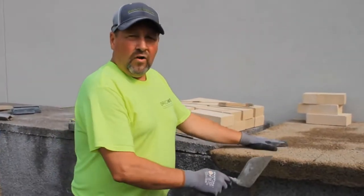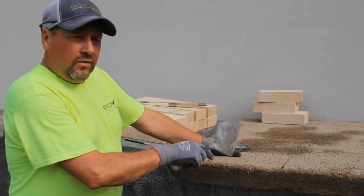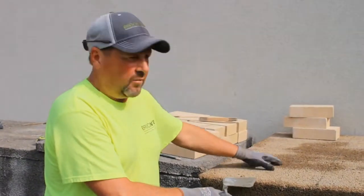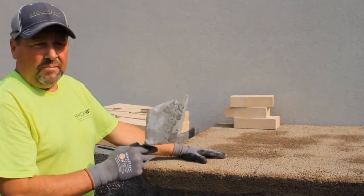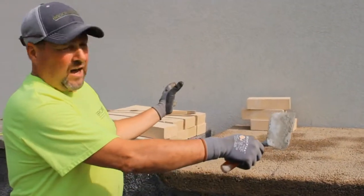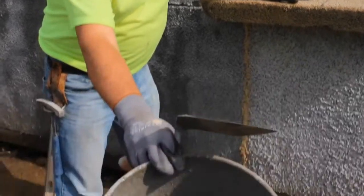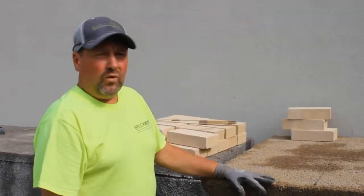Okay, we're back over at the Vecchio brick oven, pizza oven. This base has been set on top of our cabinet that we put in, and now I'm ready to put the fire brick on there. I'll do a full fire brick on the entire base, and then I'll put the 8 component piece system on top of that to create the oven, and then we can just skin that with stone. We're putting the fire brick on with the fire clay, which I've already mixed up, and ready to go.